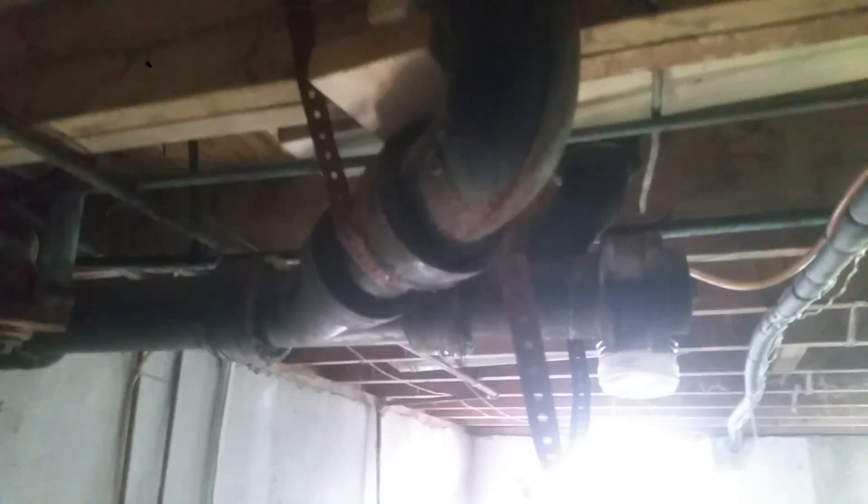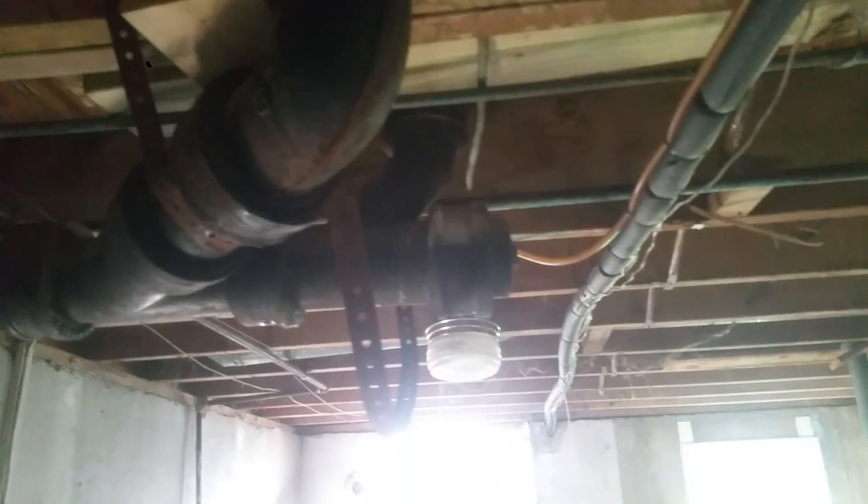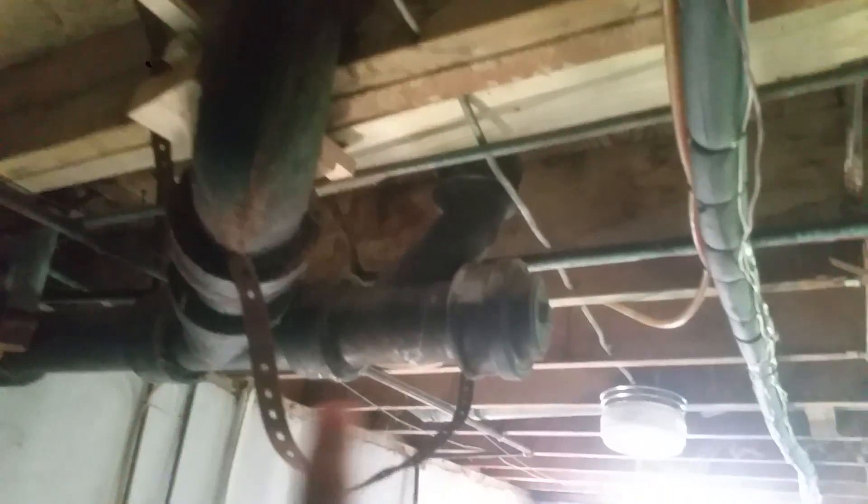The pipe has a negative pitch to it — it comes down instead of going the other direction. This seems to be elevated, but it's because he put this block in here, which changed the pitch downward. He obviously broke the straps, and now the solids — let's call it that — will back up in here and this pipe won't flow.